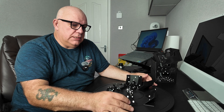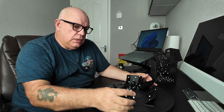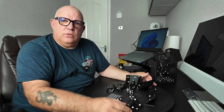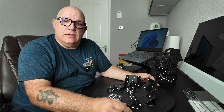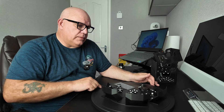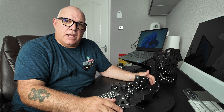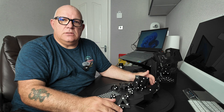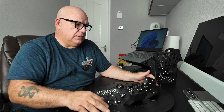The way marker dot scanning works is the little dots placed out either on the decoys or on the item itself reflect the light back to the scanner. The scanner must be able to see four or five of these at any one time, and because they're placed out randomly, the scanner records where they are and knows exactly where it is in 3D space. So even with hundreds of dots out there, as long as they're all random, looking at four or five at any moment tells the scanner where it is and keeps track of the item being scanned.